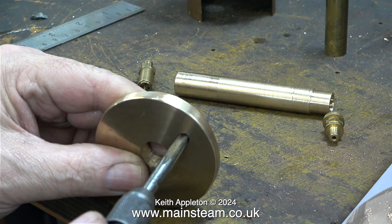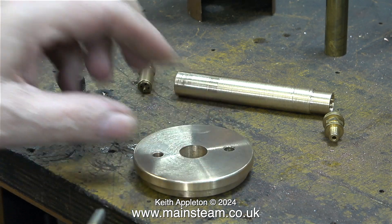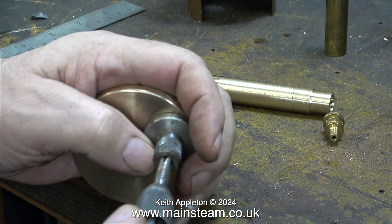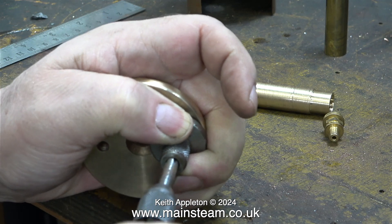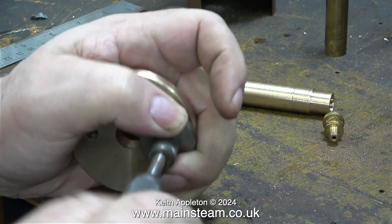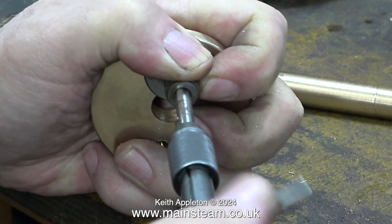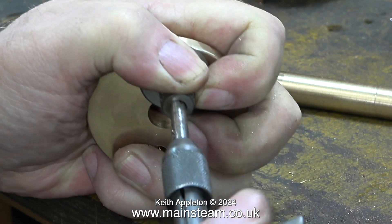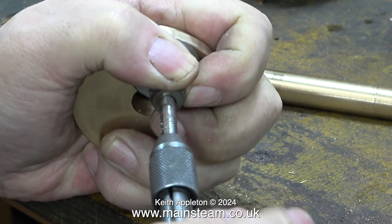The drilling marathon is over and I'm not going to forget to thread the holes. Normally I would start the tap in the drilling machine, but this time I thought I'd do it differently. A while ago I made some tap guides — you hold them tightly in position and the tap goes through the work at a perfect 90 degrees. You have to hold them tightly in position, and it's worth remembering that this tap has a very sharp point on the end.